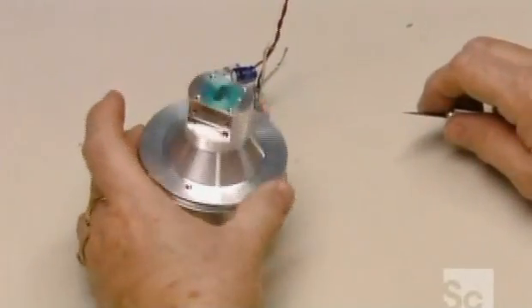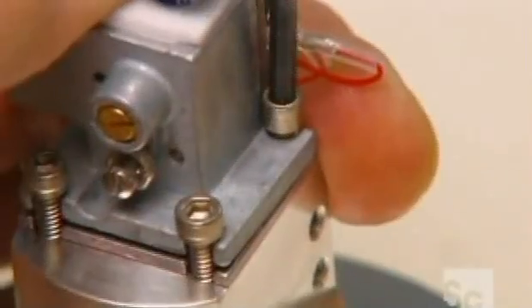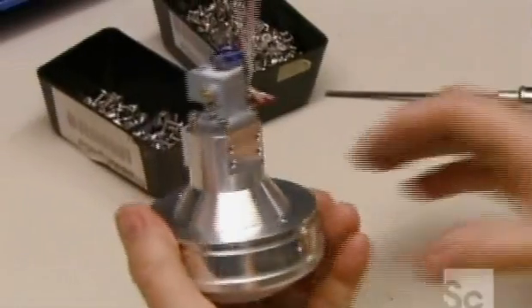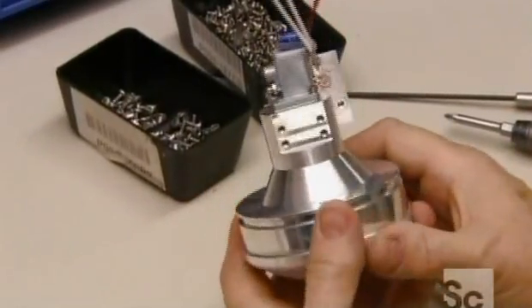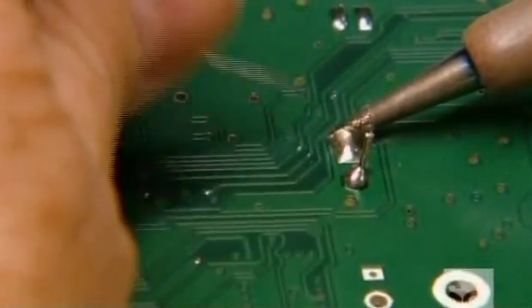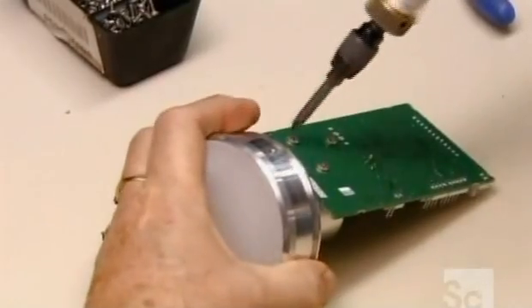The white ones will return the radar signals. This special plastic lens will focus the radar beam. She attaches the transmitter receiver unit to the funnel-shaped antenna at the back of the lens. She solders wires to a circuit board — some will carry power to it, others will deliver the returning radar signals for analysis.